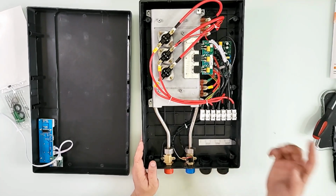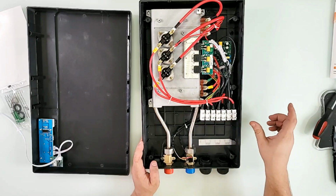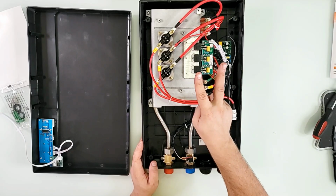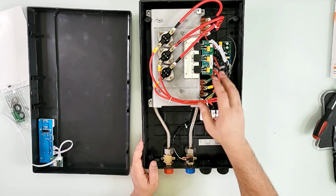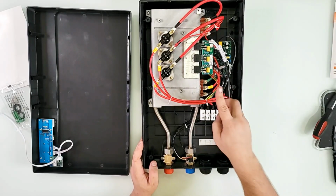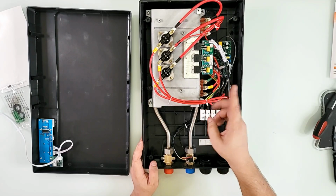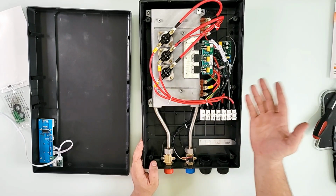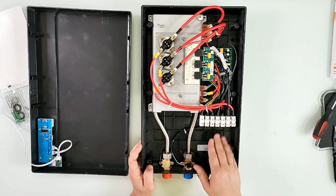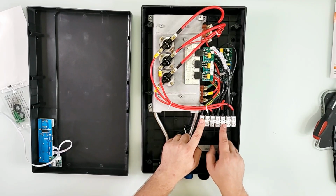So what happens here is that we take the 3 breakers, right, 40 amp, 40 amp, and 40 amp, and we bring both wires, as we know, in 240 volt dual pole breakers. We always have 2 wires coming out of them, which is line 1 and line 2, because they're both active. Here we have 120, 110 volts and 110 volts, or 120 depending on the area you live. Basically, it's kind of the same thing. And you have the lines here, should be 6 terminals plus ground. Yep. So line 1, 2, 1, 2, 1, 2.